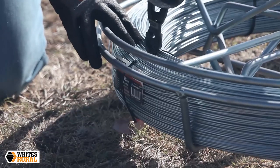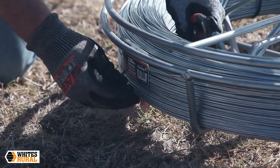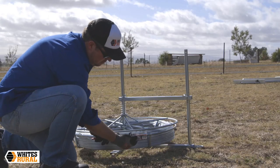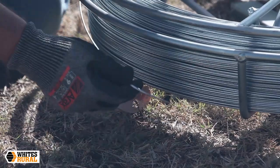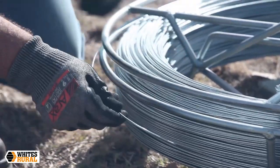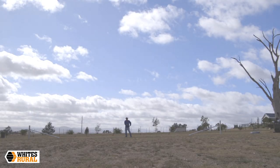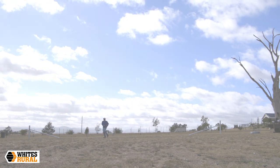Now it's time to cut the wire ties. It's important to know where the fence wire starts — this is indicated on the tag. Remove the tag, keeping the wire position and threading it through the top and bottom cradles. Handy tip: it's common practice to loosen the top 7-8 strands of wire before you run the wire out. The spinner turns to pay out the wire smoothly as you guide the wire towards the fence.